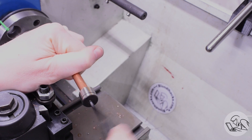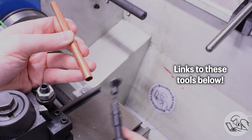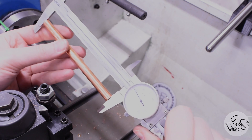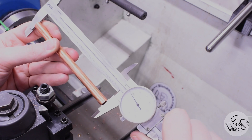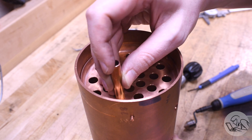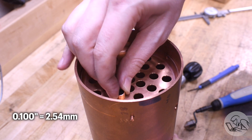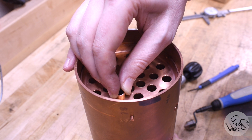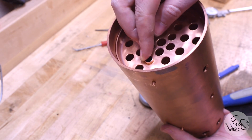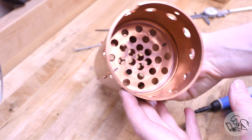I'm going to try something different instead of using the lathe for repeatability. All these tubes need to be deburred inside and out and I've got a couple of trick Noga tools for that. So that's looking good and the length is dead nuts - this is my prototype canonical tube, if you will. Now let's see how that length is on the actual boiler. I made it to the length in my drawing, but before I make 25 more let's make sure this is the length that I want. The goal is to have just a little bit of stick-up - maybe a hundred thousandths or so - above and below each tube plate. Just enough for a nice silver solder joint.